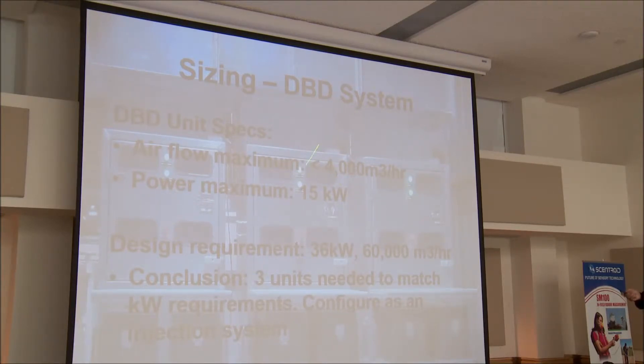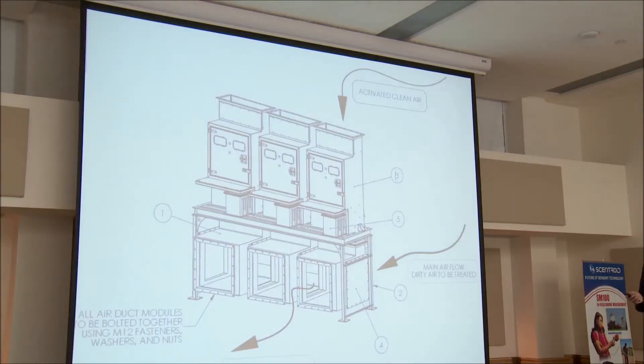You might think airflow is a limit — but it's not really, because what you can do with non-thermal plasma, and what is recommended especially in dilute air odorous applications, is put the clean air in the top, activate it in the non-thermal plasma field, and the dirty air goes in the bottom. You get immediate mixing as soon as you create the hydroxyl radicals and the other radicals, and the air coming out is treated. Ninety percent of the reactions occur in less than a second — I think 75% in less than half a second. That's how you would arrange a dielectric barrier system.